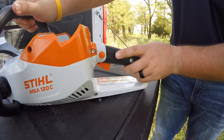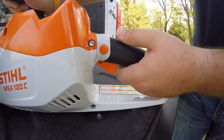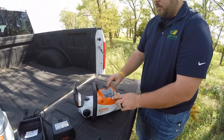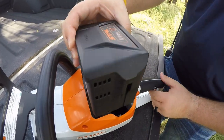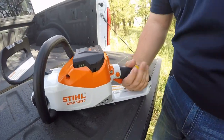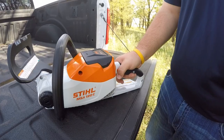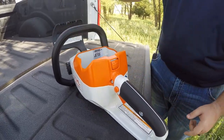Coming back to the handle, there are a few different safety features. The most important is probably the lockout button — without it being depressed, you cannot pull the trigger to run the saw. To run it, you depress that button with your thumb and then fully pull the trigger. Next is the battery chamber, where your battery slides in. You line up the grooves on your battery to match the chamber and slide it in. It has a two-position lock — one press and you hear the click: it's locked in and the battery will not fall out, but you cannot run the chainsaw yet. Push it all the way in until it's flush on top, and now pulling the trigger will run the bar and chain. To pop the battery out, there is a button that releases it and it can go back into storage.